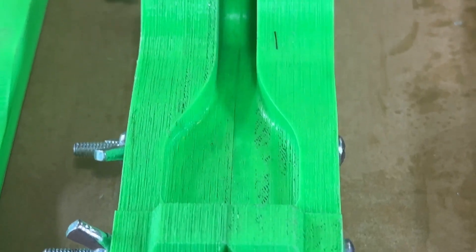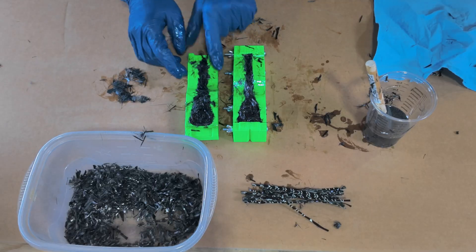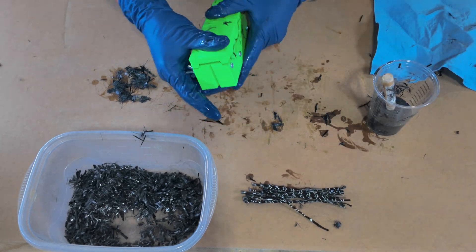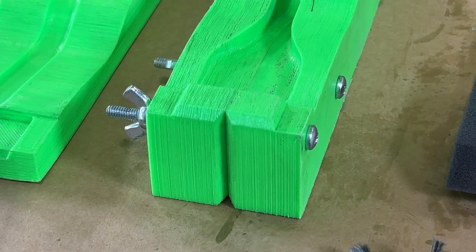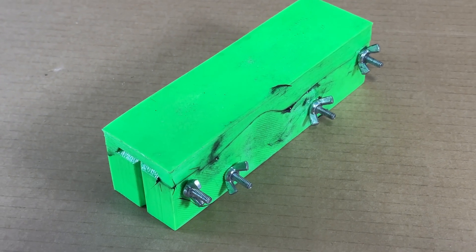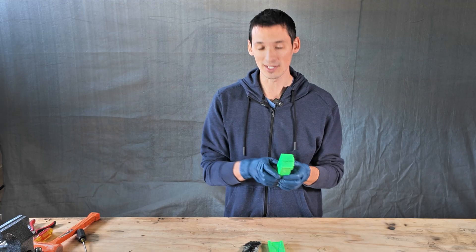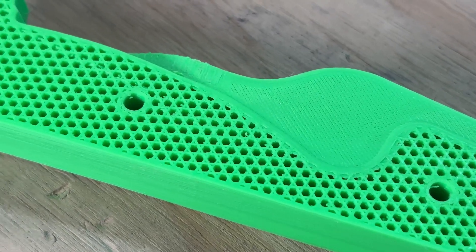So I went back to the original design with a three-part mold where one side splits in half. I also flipped the orientation on this new design so that the part came out much easier, which meant I had to stuff both parts of the mold — making sure to get enough carbon in both sides, and simply removing any excess when squishing it together. It features a specific keyway that aligns all the parts together and chamfered edges to make it easy to split. In this version it bolts together for testing, but in a future version I'm going to add clips that snap onto either side so you can basically just unsnap them and you're done. I printed this mold at 50% infill.